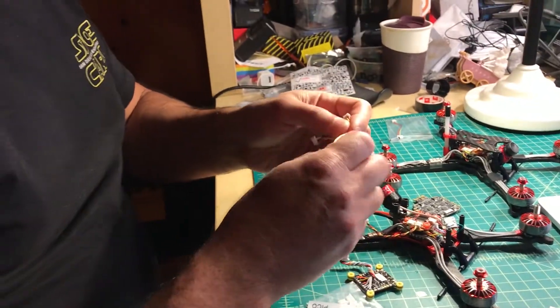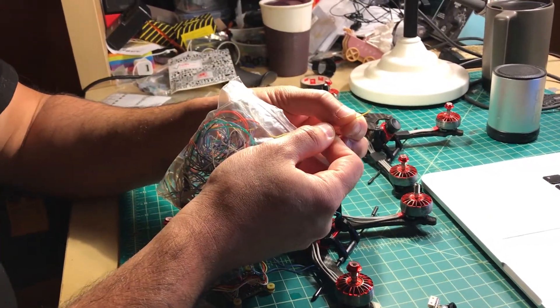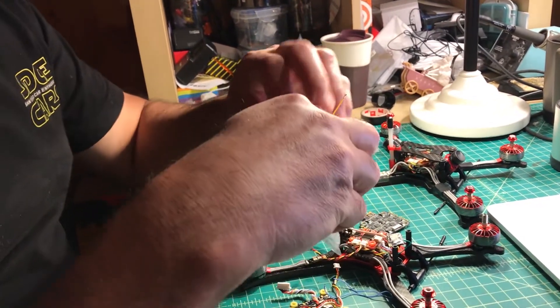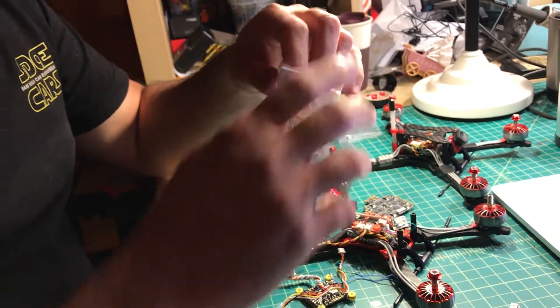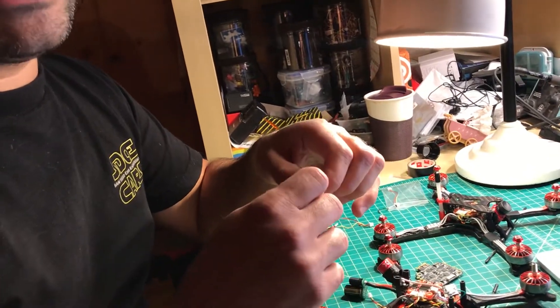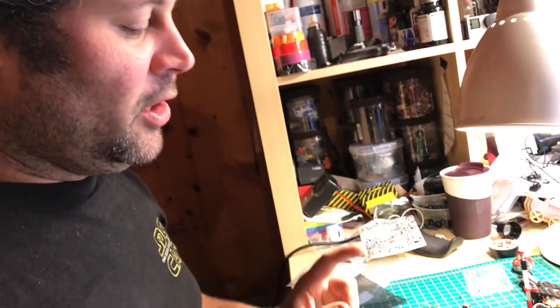When you have a long harness like this one, you want it shorter — but if you don't have pads on both sides, crimping these connectors is super super hard. I just hate it. The connector is super tiny, you can barely see it. I have the crimpers, I have the plugs and extra connectors, but just to do one I tend to damage about five because they are so tiny. With larger plugs I can get each one perfect every time, but with these tiny plugs I don't even bother anymore.